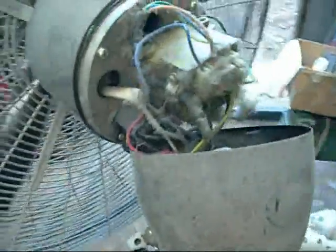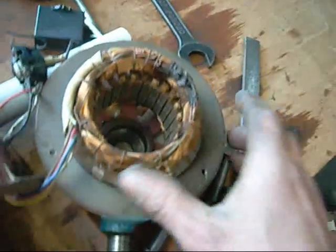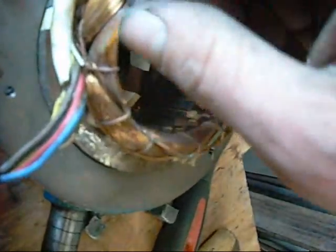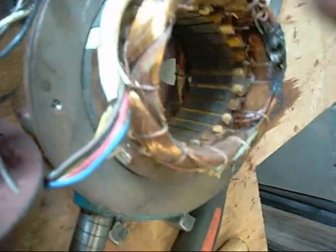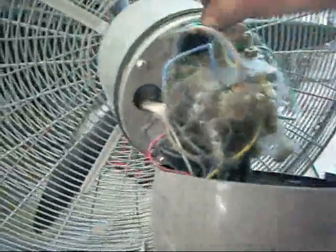This thing might have had overheating issues in summertime - that's a lot of dust. The motor is different to the one Brad has, which has had a rather nasty burnout. I showed it to a motor rewind guy and he ummed and ahhed and asked me how much I want to spend on it - so yeah, it might be a little bit too far gone. That's all burnt off and even in there is burnt. I'm thinking this is a full rewind job, not just try and patch it up, because it's beaten and burnt through to the windings. But if the stator from this one is the same, we might be able to do something - I don't mind parting this one out if the rest of it is wrecked.